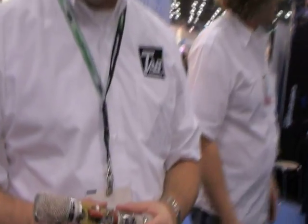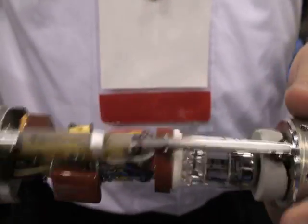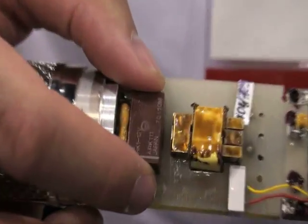Oliver got the spec sheet, got a couple of samples, tried it out, and said this is an awesome tube. He then reworked the original C12 electronics so that it would match all of the needs of the tube. One of the things he added that was very interesting was a relay. They didn't have one this small or this cheap back then. It shuts off one side of the capsule. So when you put this in the power supply and switch it to true cardioid, literally just one part of the capsule is working. It eliminates the phase issues and the problems with the two capsules working against each other when you have a modified cardioid.